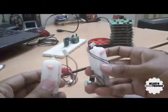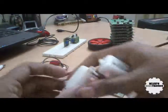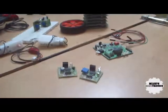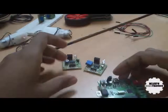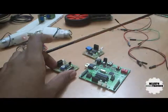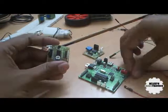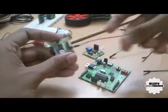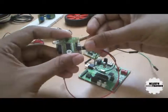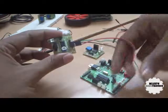We have two DC motors and these pins are directly plugged to the robot controller board. I am going to use color coding to make it clear: red is going to be for 5 volts, black is going to be for ground, and green is going to be for output. I will plug the red wire to the 5 volt pin, the black wire to the ground pin, and the green wire to Port C bit 0, which will be my input port.